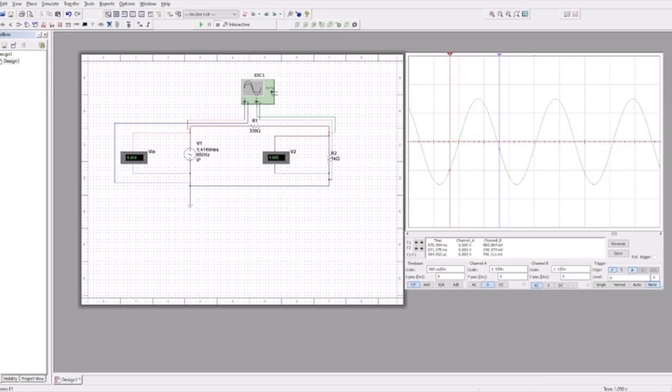It's Colin. I'm recording the peak to peak and period of V2. The first thing we do is put the cursors for the period at the correct spots and then measure the period, which is at the bottom. Then we set our Y minimum and Y max cursors and read what's at the bottom, which should give us our peak to peak value.